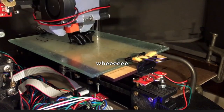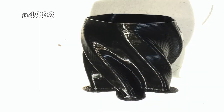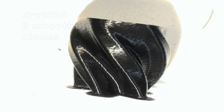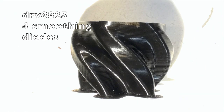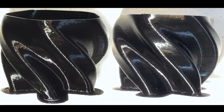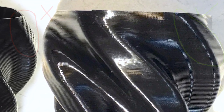So now we just have to do a dozen or so more prints. The Allegro chip prints are going to be our standard — as you can see, they printed out pretty well without any patterns, whereas the patterns are very noticeable with the Texas Instruments chip with no diodes. Now let's move on to the Texas Instruments driver with just a single pair of smoothing diodes — and as you can see, the pattern already got a whole lot better. I was actually surprised how much better it got with just two. But with two pairs of diodes it got even smoother, and then when I upped it to four pairs of diodes it got smooth to the point where you virtually couldn't tell the difference between the Allegro print and the Texas Instruments driver print. Zooming in, the Texas Instruments driver with four pairs of diodes actually printed some of the layers a little bit better than the Allegro driver.